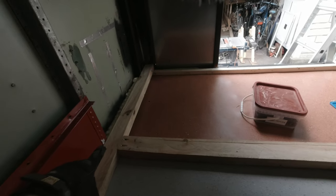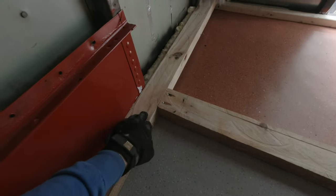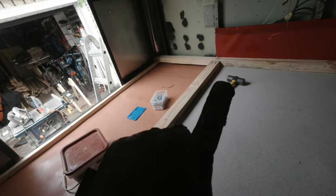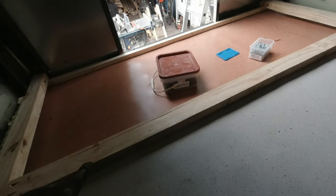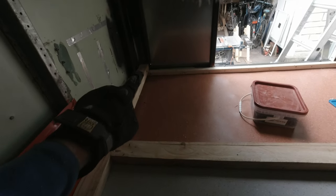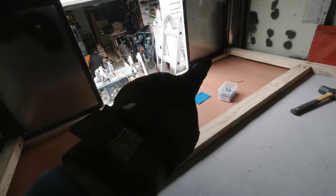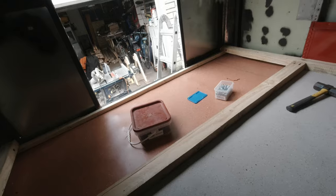Okay, so I placed the first transverse post. I used a Kreg jig to secure it onto this one and this one over there. I made it really flush, really tight. I had to use the hammer to place it down, so this one is not gonna move at all. I also used some deck screws that I still have. This way I attached this 2x3 onto this 2x2 right here, so it's properly attached and already secured.